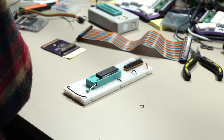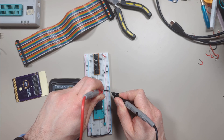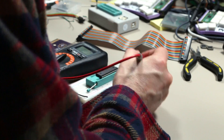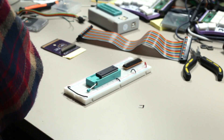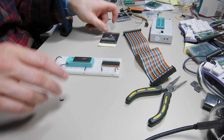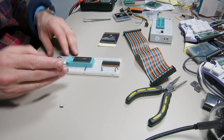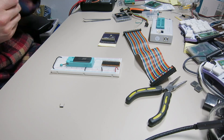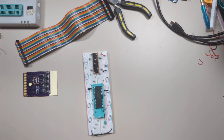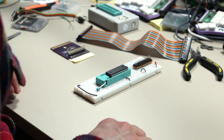Let me double check I got that right — I'm just using a multimeter with its continuity setting. I got it wrong — good thing I checked. Now what about A15? It just so happens that the Game Boy was designed so that all addresses meant for the cartridge's ROM chip have A15 set to zero. This chip is never going to see an address where A15 isn't zero, so we can actually tie A15 to ground as well.